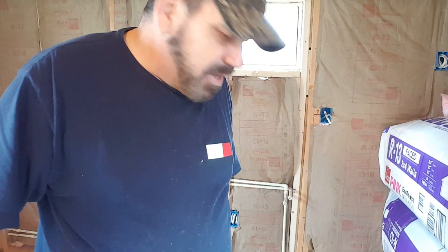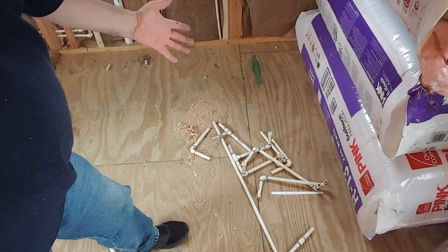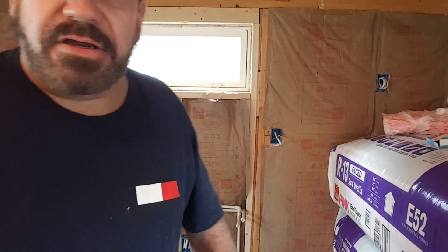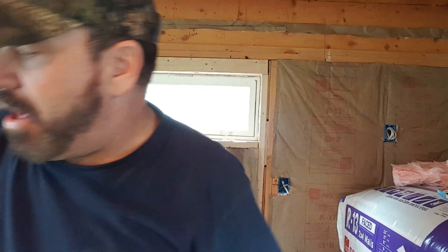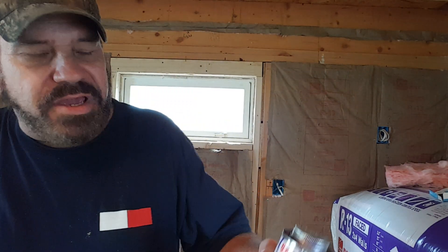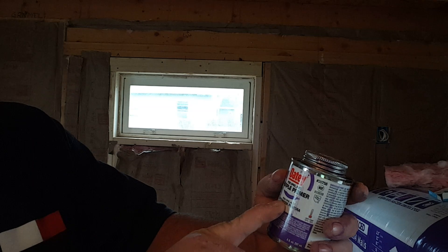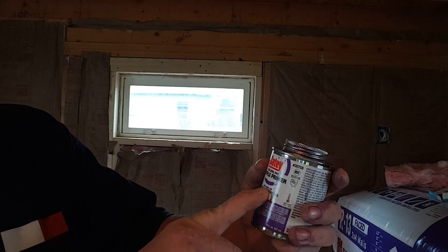So why did I rip out all the old plumbing? This is really all I have left. I only used two sticks this time — the first time I used four — and I used a lot of the scrap. Can you call it scrap if it's never had water through it? Let me explain why I did that. We used the purple primer cleaner, which is good for both CPVC and PVC. And then we used the blue glue — medium blue PVC cement.